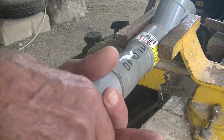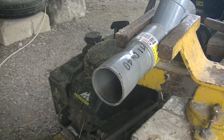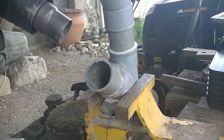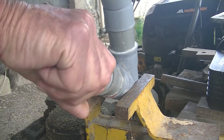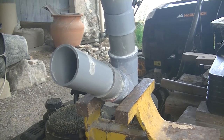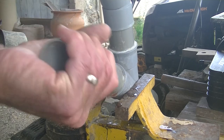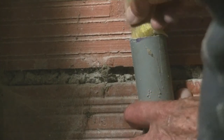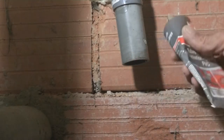After it's cooled down you can just pull it out and you've got a perfect join. Now I'm going to do the same to the other side — once again pour water over it and cool it down, you can pull your little piece out, and there's your join. I'm just going to chamfer the edges and make sure there's no rough spots in there. Now I've got some PVC weld and I'm going to do the top one first.